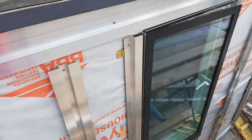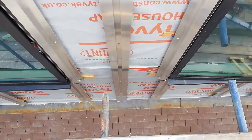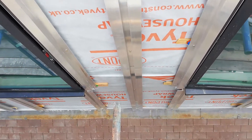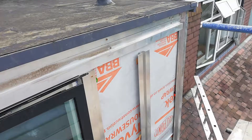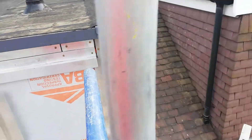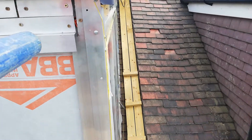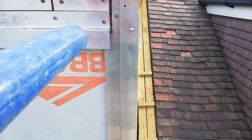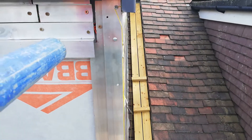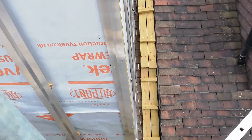We're going to fix the panels nicely to those windows and we have a minimal 3mm gap to the panel. We also have a ventilation gap at the bottom which will allow air to go in and come out, in line with the windows for airflow. The main thing with the cladding is you have to make it plumb — it has to be lined up nicely, otherwise you will have steps between panels which wouldn't look good.